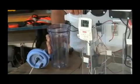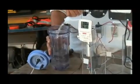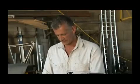So we're going to pour that in. We don't want to fill it up all the way — just halfway would be fine. Now we're going to put our anode and cathode array back inside. And that's basically how it sits. Now we still have to put in our electrolyte, which is KOH.